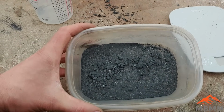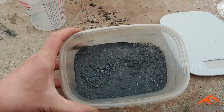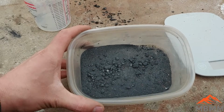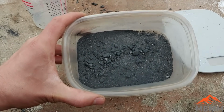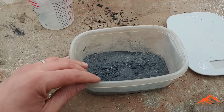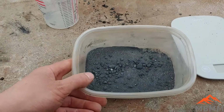So that way we could get pretty much a pure copper anode with just the precious metals. And we would have the lead and the tin and the nickel and the other base metals that go into the slag, that if we wanted to recover them later, we could recover them with another method. But if this works, this might be a good way just to mix a bunch of copper oxide with the number one concentrates, some slag or some flux, and smelt it down and get a nice, clean copper anode with precious metals.